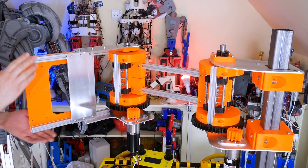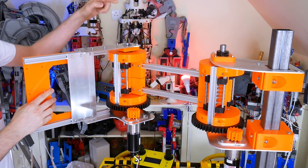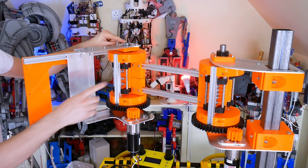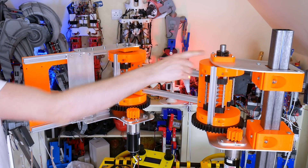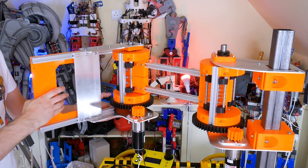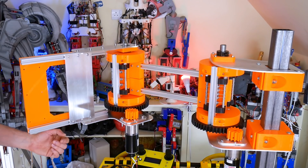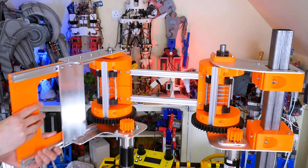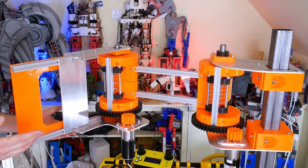So there's my extra bit of the arm installed, and again we've got that force-driven hub so that we can force it there, and we can measure the output on the shaft at the top to get the actual position referenced to the encoder position. Then we can work out the force, and we can do this on both axes. The plan will be that we can train it by bending it around and having the motor catch us up. I've put extra springs on this one, which is actually back-driving the motor, but it won't do that once the encoder's working and we've got power on the motor. So we can basically yank it around to train it and then have it replay the positions — that's the basic plan.